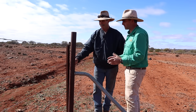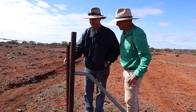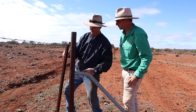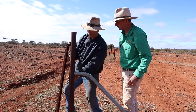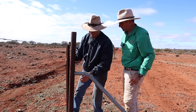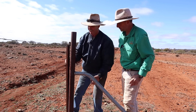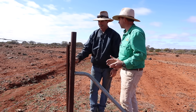You also twitch these posts onto the wire pretty tight. The little clips we use — instead of going once around the wire like on a normal post — we do a second lap around the wire with the clip. Because this star picket is hinged at the top, there's nothing to stop it moving up and down the wire at the bottom. So to keep the post reasonably vertical and firm, the second lap with the post clip is used. With floodgates, counterintuitively, twitch off tighter than you normally would — keep it reasonably firm.